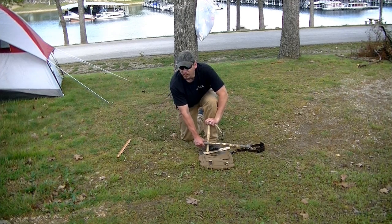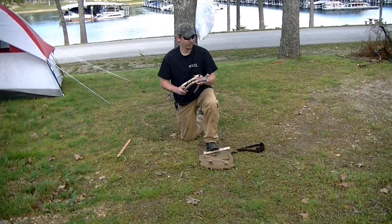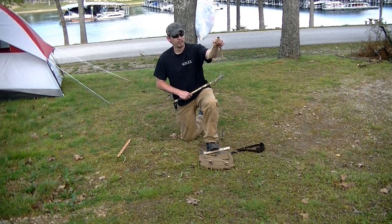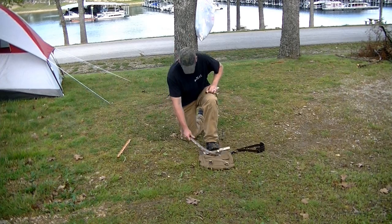Hear that squeaking? Does anyone know what's causing that? Pressure. Pressure and? Moisture? No. Insufficient friction. It's chatter. Oh, it's blackened. It's hardened. Yep. That right there.